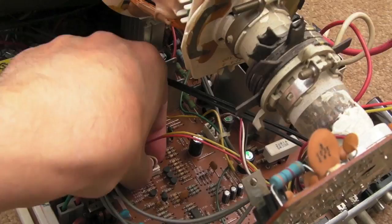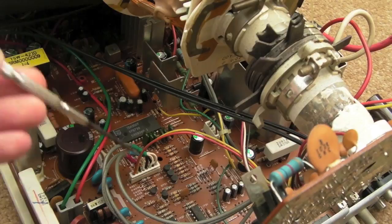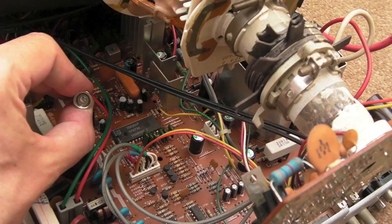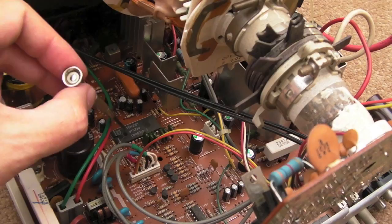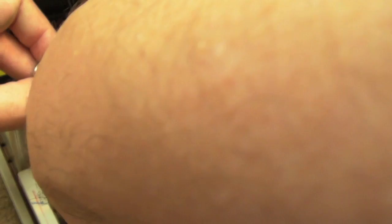So the next thing I need to do is try and work out why the blue feed is low for a period of time - it's temperature-related. I don't know, we've got this chip here - we're feeding a composite input - there's going to be a chip - I might just look at the pinout of this chip here before I do anything else, this TDA3507, just to see how it works. I can just do some connectivity tests and things around here, measure some of these resistors - I think I've checked the block of resistors there. There's like two pairs of resistors just down here - those are all alright.